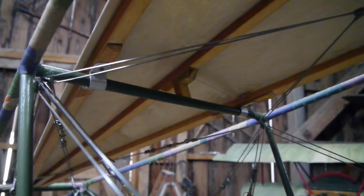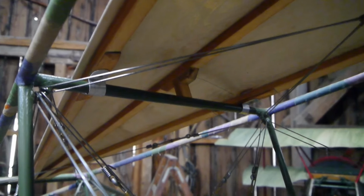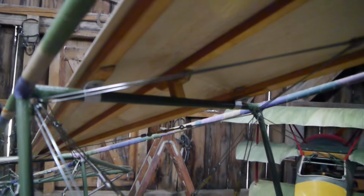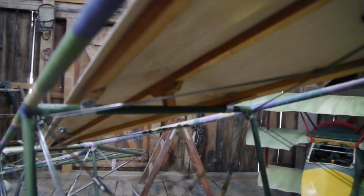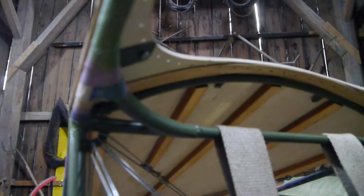Small aluminum clamps hold the turtle deck down, and the wooden support prevents the tension of the covering from pressing into the back. At the front, the turtle deck is bolted to the fuselage structure using welded lugs. This is the whole secret of this component.